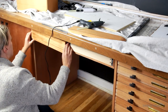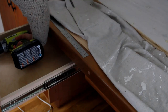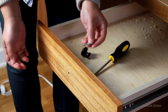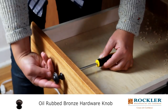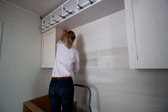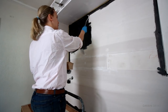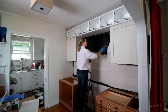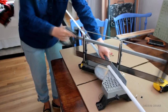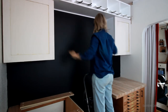To secure the face frames, I first positioned them with hot glue and then secured them in place from the inside. Since this space will be for education and creative work, I really wanted chalk paint on the back wall. We had previously put up plywood partly to hide the textured walls and to give more flexibility for where to put things. Chalk paint is such an easy and cheap way to transform a space, and really practical too. Then some quarter-round trim is nice to add since it really gives a nice finished touch.